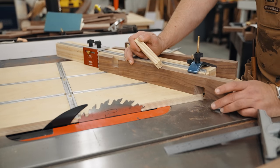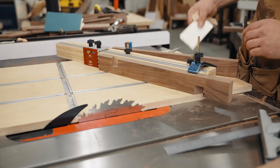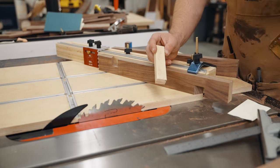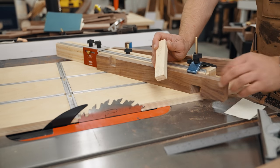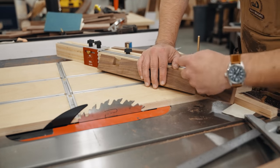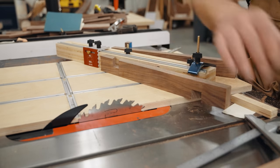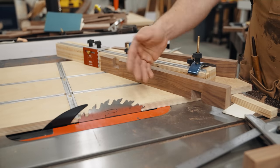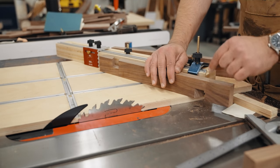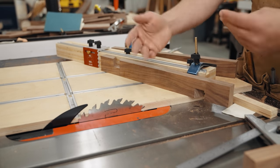One area where you could get tripped up is if you're not quite at 60 degrees. I'm cutting this joinery a little loose — the glue will fill it — but you can adjust by adding a couple pieces of paper or shaving down your spacer. Make sure you do some test pieces. It's a fraction wider than I'd like, but with glue it'll be perfect. The reason you want to cut them as half laps for now is that this will get an angle that follows the leg, and you can either trim it flush or leave it hanging over an eighth so you can round it and make it look cool.